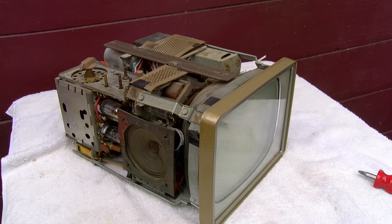In my thinking, any of those restore or repair methods on a CRT tester, the rejuvenate, the clear shorts, that's all just a temporary band-aid measure that was really supposed to be there to get by long enough for the customer to order a new CRT or buy a new TV. Those are not permanent fixes. Those are temporary band-aid methods just so the tech can order a CRT and schedule getting it installed. I don't know about that clear G1 shorts. Is that a permanent fix? You know, am I going to spend 5 or 6 hours recapping and fighting with this, and then have the stupid CRT short again, and then I have to open it up?